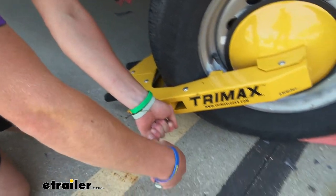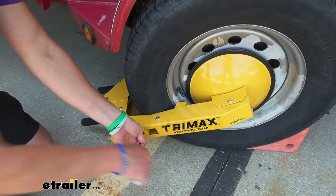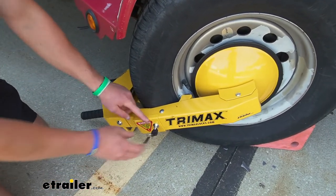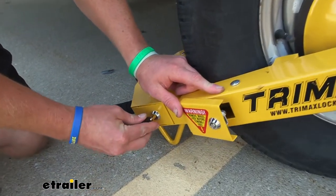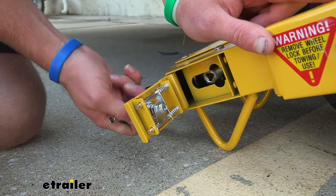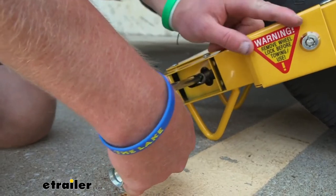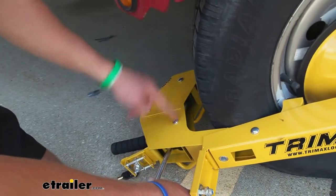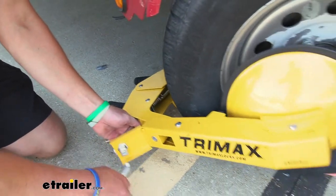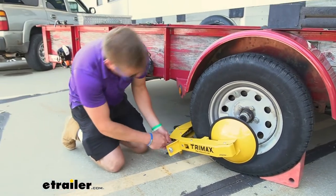We're going to put this in and loosen it up. What this adjustment does is loosen and tighten this little section from this bolt here — it's going to pivot, so as I loosen it counterclockwise, we'll have a little more play. Loosen that all the way, then take that same key and go over to unlock the other door. This one has quite the mechanism inside and it is spring-loaded. It's the same pick-proof circular tumbler, and the same tool loosens this one. As I loosen it, you'll see it kind of spread out. Get it spread out enough and you can take it off.